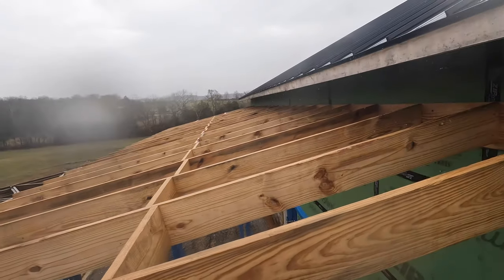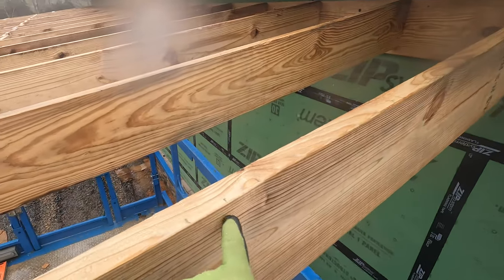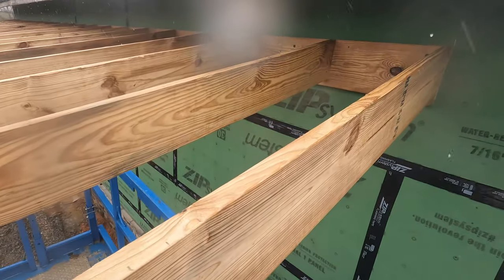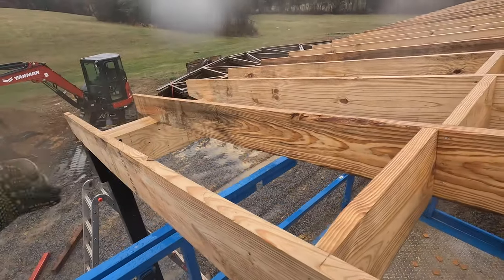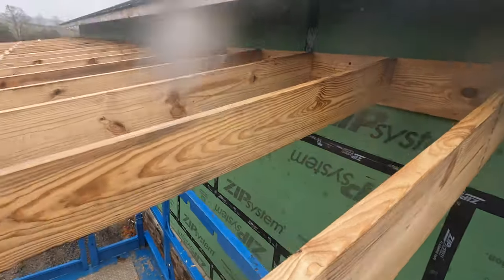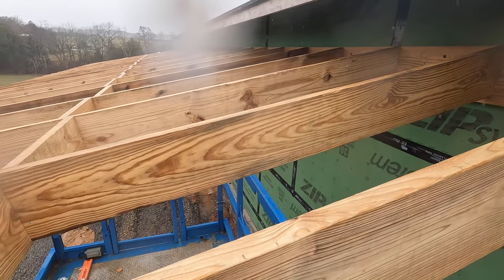I got a feeling I'm going to get wet today. I'm working on fixing my overhangs — I'm going to notch out the first two joists, then run one out the length of my overhang, notch it down into those first two joists, and tie it into that third one. That way it'll come out and support the overhang. I'll come back here and block it. I need to notch these two out here, and then I'll do two more down here, that'll give me support for the fascia on the end. I've already got the other two down on the other end done.